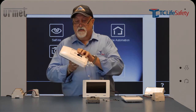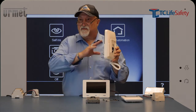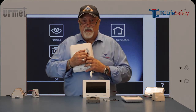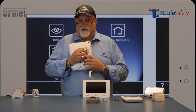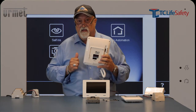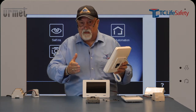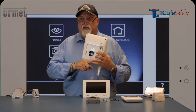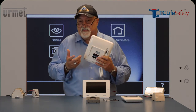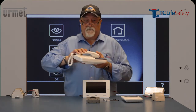There are switches in the back. There's a two-position switch that tells you whether this is the master or the slave, if you have two consoles. Then there's a three-position switch which sets the time delay for the buzzing-in function — essentially, how long does that buzzer buzz for somebody to get through the door. The options are 300 milliseconds, three seconds, or six seconds. My suggestion is pick the six seconds: they'll hear the buzzing for six seconds and at least they'll get through the door in time. And that's the Simply.